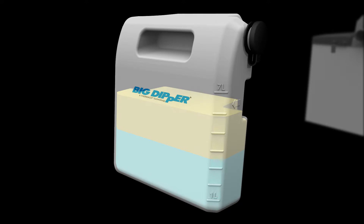The skim setting chosen should be based on the contents of the grease collector after a skim cycle. If there is a significant amount of water in the grease collector, reduce the run time — for example, move from setting 4 to 3 and recheck the contents of the grease collector after a few days.